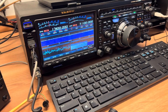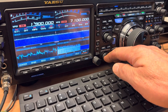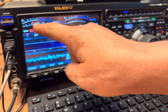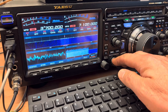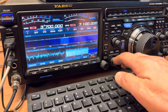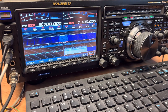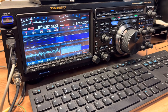Back at the station — this is the noise I've got on 160 meters. Let's go to 80 meters and see — yeah, it's not great. You can definitely hear it. I'll try and listen for the 80-meter net tonight on 3.7 megahertz and we'll see if I can get into the Alberta Public Service Net. If conditions are good I should be able to copy the net, but that's a lot of noise.